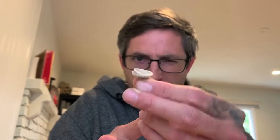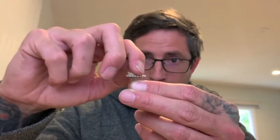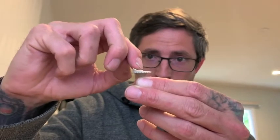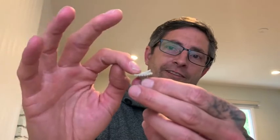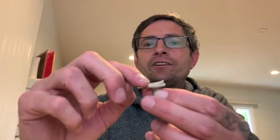We're moving that dwell to the retracted position as much as possible. You cannot remove it entirely, but quite a bit of it has been removed. So you'll see on this that on roughly half of the cycle, this half over here that doesn't have the bump, it's flat. And the reason for that is that's the retracted position. So the needle comes back, it stays retracted, and then as this is rotating, it's pushing the needle forward and then pulling it back. But because half of the cycle it's spent in the retracted position doing nothing, it reduces the amount of in and out by at least 50%.